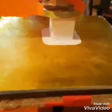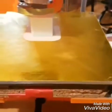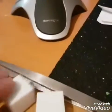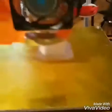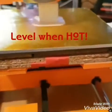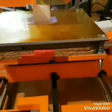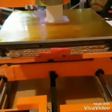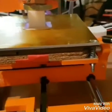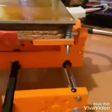Scuffed up the Kapton tape with some P600 wet and dry, then cleaned it off with some isoprop because I was getting lifting on the bottom right corner again and again. Yesterday was a tear-your-hair-out day. Today's been better — re-leveled it all when the bed's hot. The bed won't heat up without the extruder being hot, so I backed all the filament out, cleaned it up, and re-leveled when hot, and that seems to have helped.